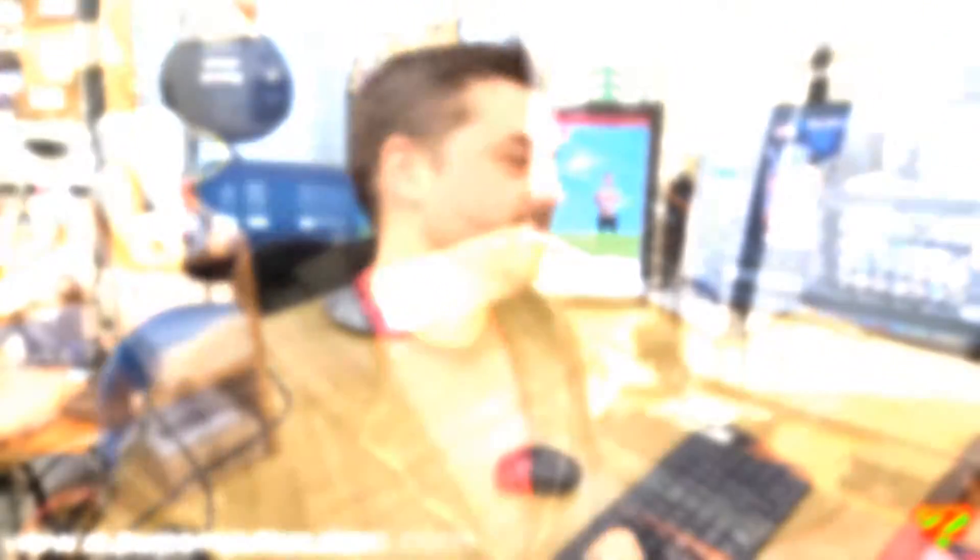This particular card is a Sapphire Nitro Plus RX 580. The gentleman who brought it to me was having an issue where it was basically just giving him a black screen — it appeared like his computer wasn't posting. The card was dead but not dead dead. The original footage had terrible audio cutting in and out, so I'll narrate through my troubleshooting thought process. I had to tear down the whole card and replace some blown fuses.